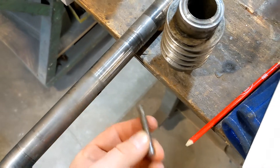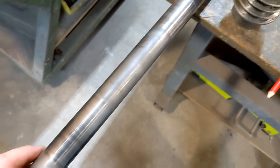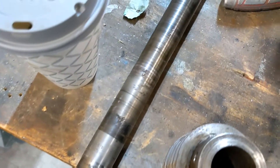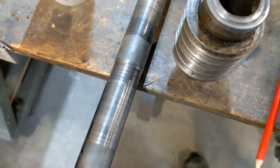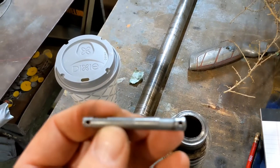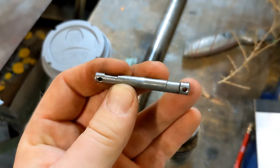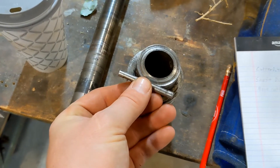Okay, ladies and gentlemen, we ran into our first problem. The machine we're working on is nearly turn of the century — we have a very large worm gear here, and they are relying on a kind of older technology not seen very often today, still used in places. You can see this old shaft is fairly worse for wear; it runs with Babbitt bushings and it's well scored and well used. So our thought was we would just throw this back in after center drilling the hole on the other shaft. Unfortunately, they use a taper pin — you can kind of see that this side is larger — you can see the profound wear where this was pinned through this worm gear and through the shaft.